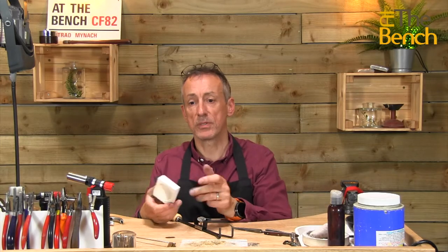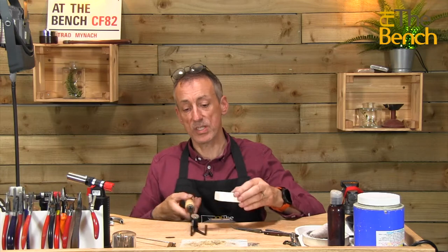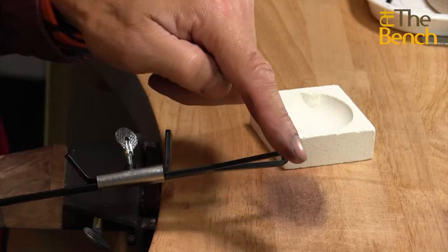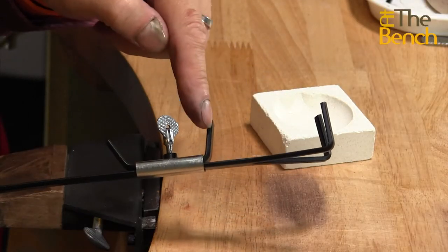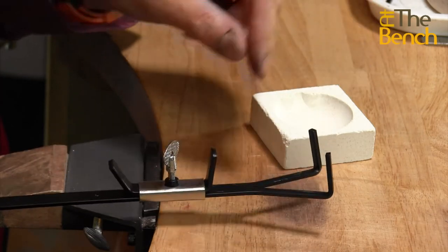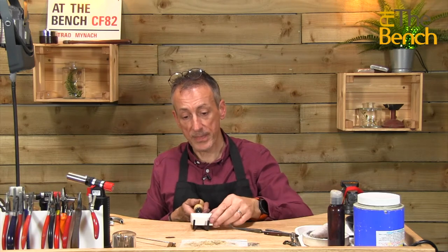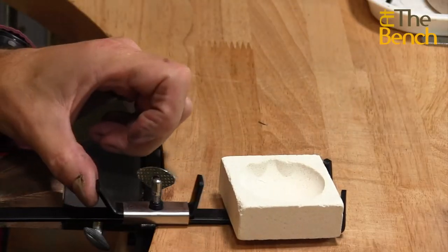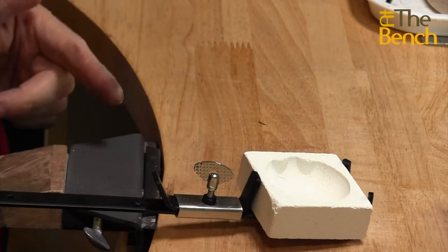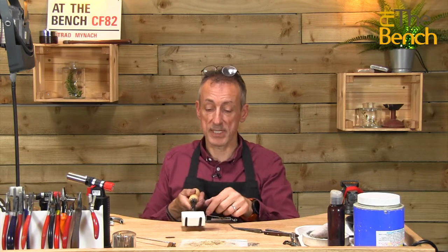Here is a typical crucible - we haven't prepared this at all - but the idea is you've got these ends that are at an angle facing in this way. Either this little section here is pointing upright or pointing towards the little claws. The crucible goes in the end; slacken that off a little bit. I'm right-handed so I'm going to hold this in my right hand and pull in this direction so the lip is down here.